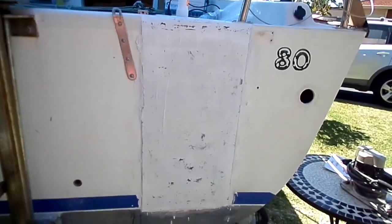The fairing compound I put over there is all nice and hard, so I'm going to sand it back with the finishing sander. Another day — yesterday I managed to get the patch on the back sorted: two layers of chop strand, a layer of six ounce cloth, then another layer of chop strand. I put some fairing in there too. The fairing is a Q-cell mix — first time I've used it. You need to mix it about one part resin to two parts Q-cell, then use the right amount of catalyst for the resin. It's a fiddly thing to get right, but it's there dry. I'll sand that back and give it a coat of flow coat and that's done.